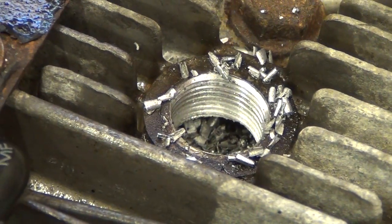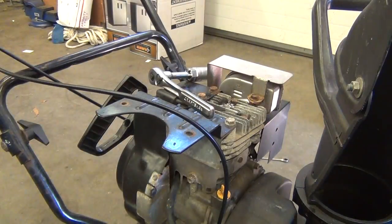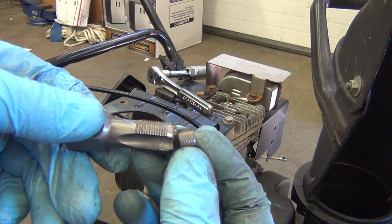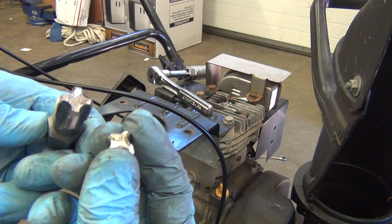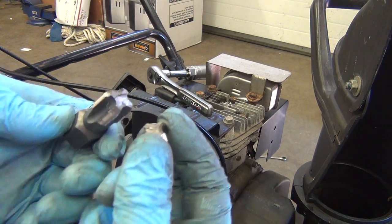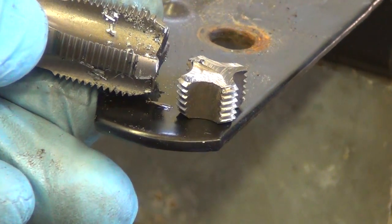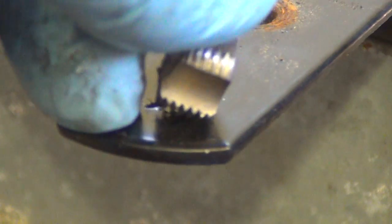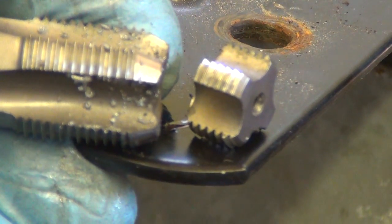I used the tool to tap the threads right in place. Here you can see I've tapped it right in place — I know that's not good practice to make a bunch of aluminum threads in there, but I closed both valves and blew it all out with the air hose after. I took my angle grinder and cut the tip off, and you can see it's got a big taper that starts the cut — and son of a gun, that thing cut right into the soft aluminum and made a really nice thread.